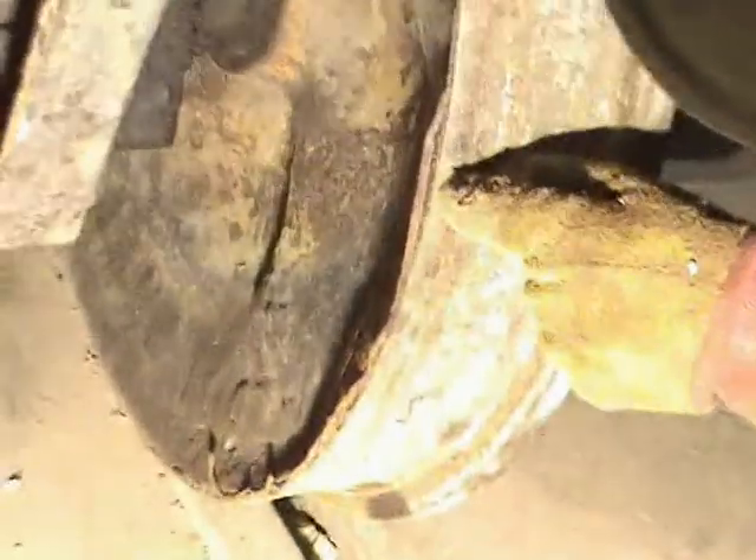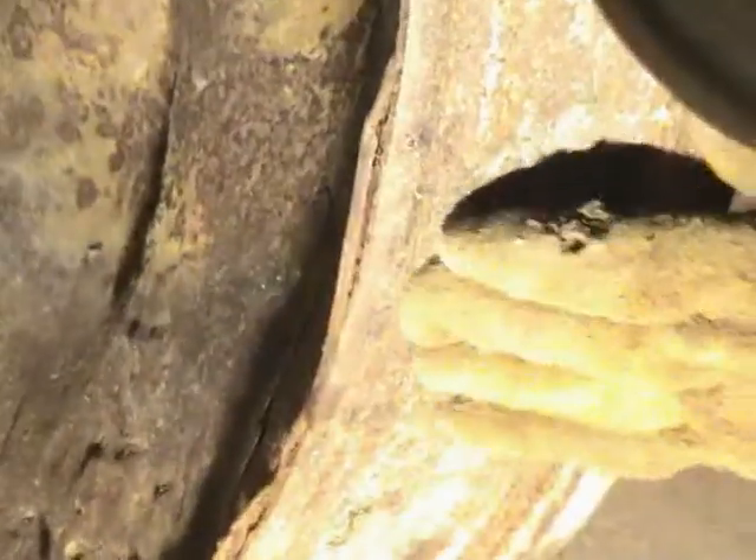These wheels have worn down — look at the end there — worn down pretty thin. You can see right here how the metal has kind of worn and worked its way over. This wheel, while it would probably work here for many, many years, is worn down to the point it could not be used in regular operation. This tread should be probably an inch and a half to two inches thick — in other words the wheel would be almost two inches larger in diameter.